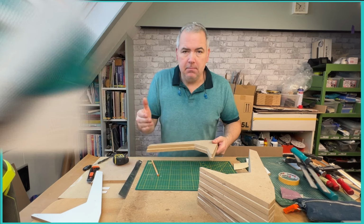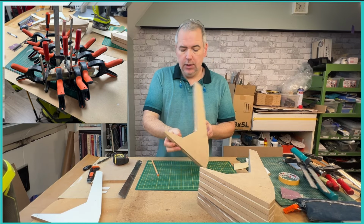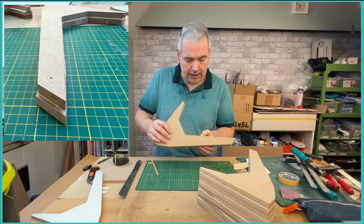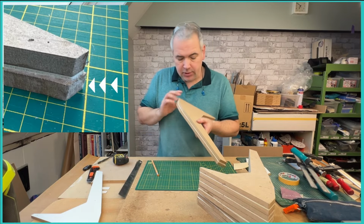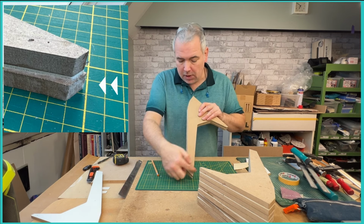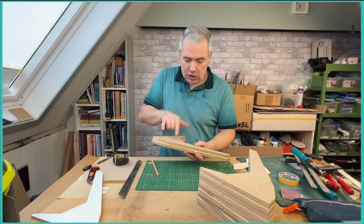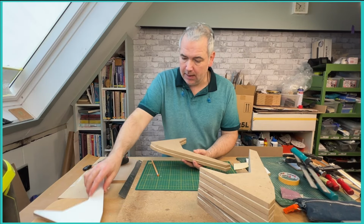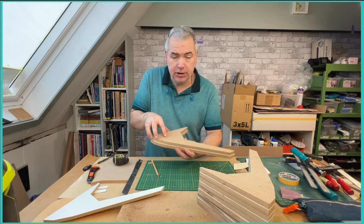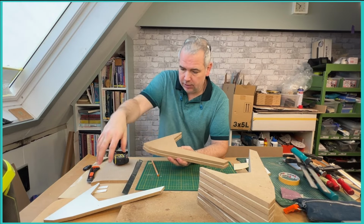That was then machined back, and then that was glued on, like now, to another piece of wood or MDF, which was slightly oversized. So there's a slight step now, around this, of about 2 to 3 mil that's oversized. And the idea now is that I use this original first template that I made, or the first part of the leg, which has been cleanly cut back to the original template.